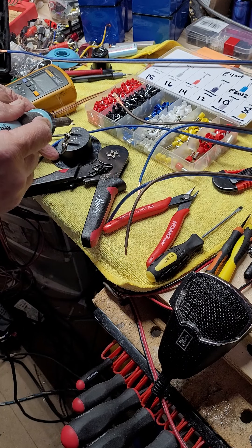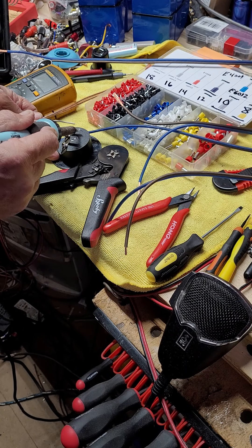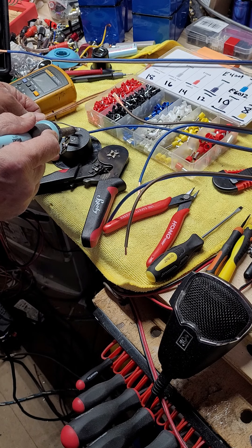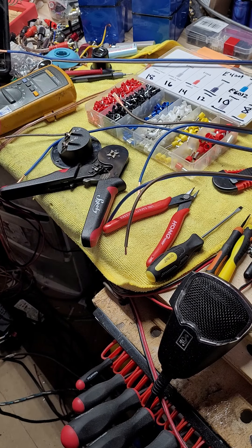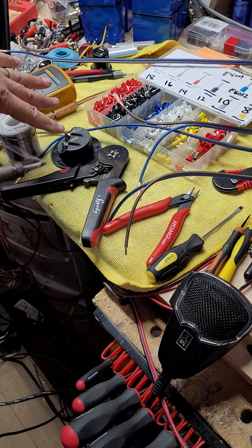It's already stuck. One more time to get a little extra coat on it. Count to ten, then apply solder. All right, that's done. Now you've tinned the leads. Now we're going to tin the end of the stripped wire.